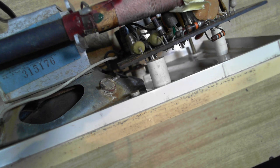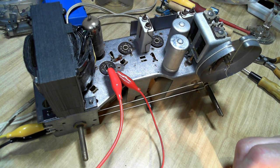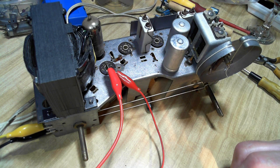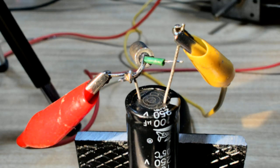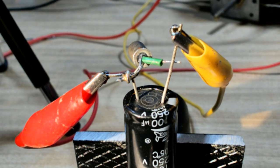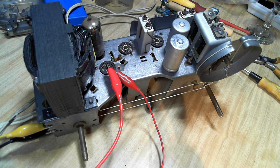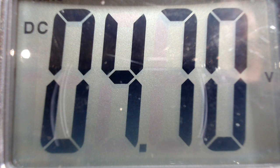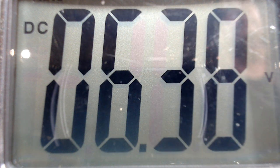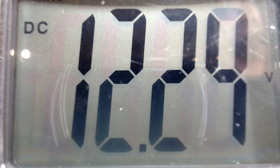Let's see if I can find some more power and have another go. I've connected the capacitor to a radio I'm working on and just stealing a bit of the DC off that, so we'll get near 100 volts I would think. I'll just charge the capacitor - the little transistor's not touching anything at the moment. I've got the variac on, so the rectifier is kicking in and we're just getting up some voltage now.